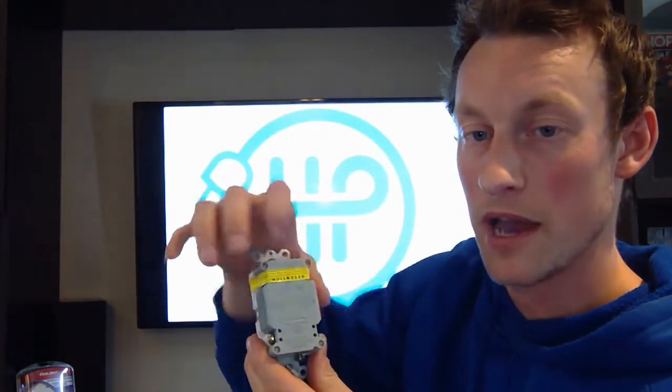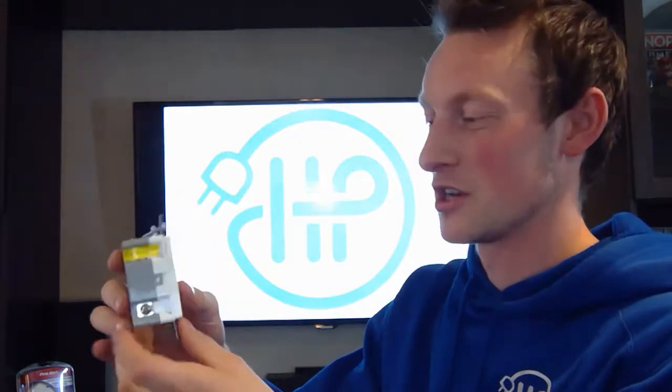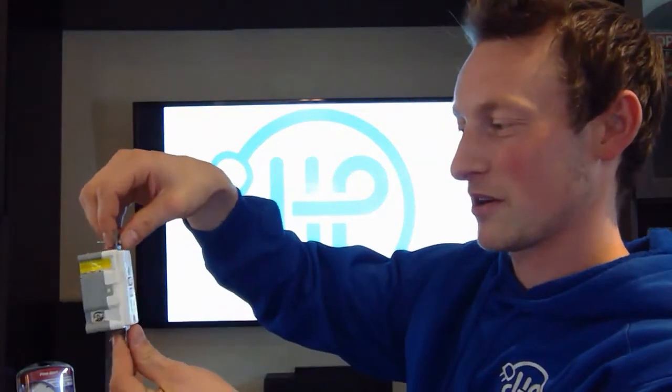Your load side is for protecting multiple outlets from this device location — power in, power out. Keep the yellow tape on there because over time the writing on the back may fade. Regardless, your local electrician should know: line comes in on the bottom, load out on the top. Power comes in from the bottom — it's a trade tip. Your panel is in your basement, lower than everything, and power comes in on the bottom. You may encounter different scenarios, but if you do, give us a call at 780-935-0622.